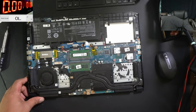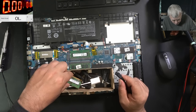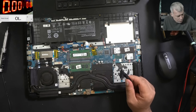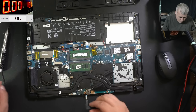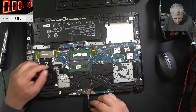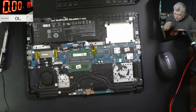Let me plug the charger — I'm not sure if it will work with my charger. Acer, blue Acer. 19 volts, about 4.6 amps. Plug in the charger — it's fine. Let's plug the battery. I swear something blew up. I heard the power supply clicking, which means the main power rail is shorted again.